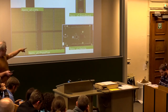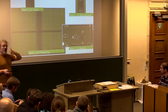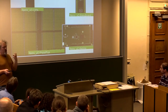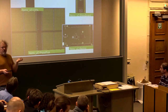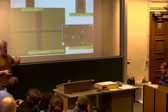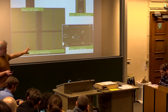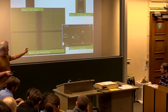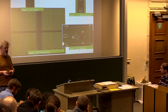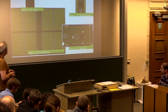The STM32 has on-chip flash so once programmed, you just provide 5 volts on the USB port and it boots the Retrino microcontroller from the STM32 — it can run standalone. The chip IOs use 5 volts, while the logic runs at 3.3 volts, or 2.5 volts if we can go to a lower technology node. These are the options I foresee for the crowdfunding campaign.